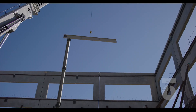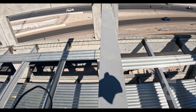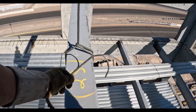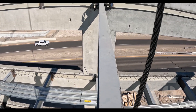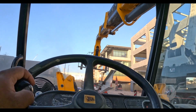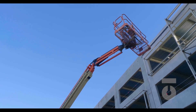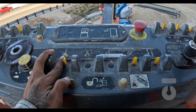The steel erection process is a dangerous process. With steel flying overhead and ironworkers scaling six-story buildings and more, falls can happen. That's why you don't just work in the field right out of the gate. You need to be at least to the stage of a labor operator — you need to know how to operate forklifts, scissor lifts, and boom lifts. You need a good base understanding of all the tools of the trade, fall protection, how to read your drawings, and ideally you should know how to weld to code. You need to know what you are doing and be able to identify hazards so you can take the appropriate steps to be safe and competent in the field.